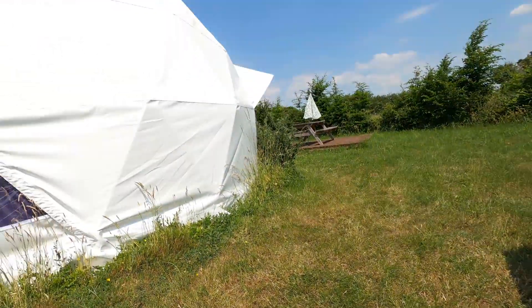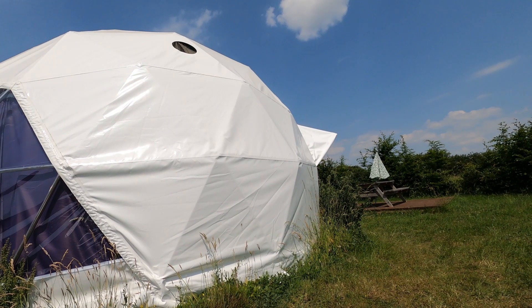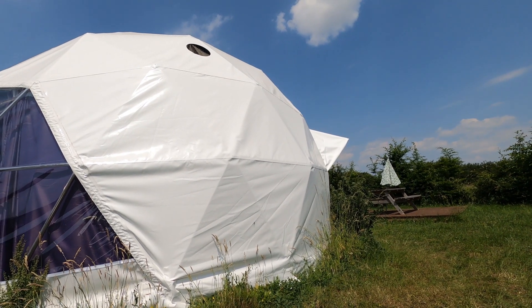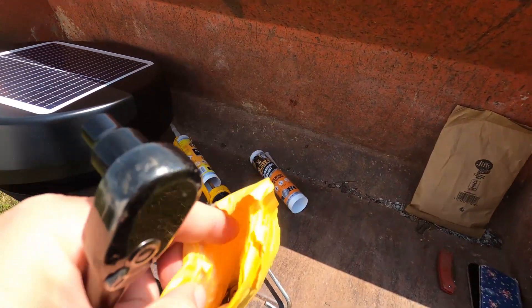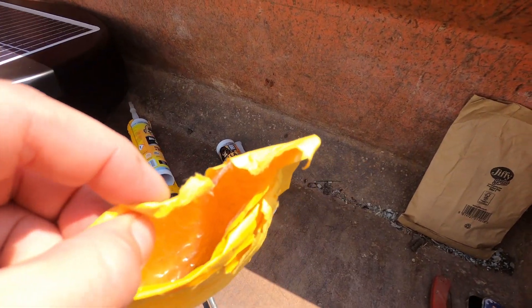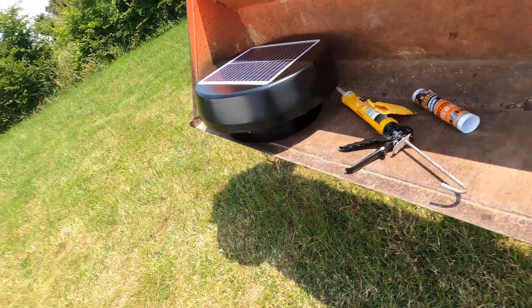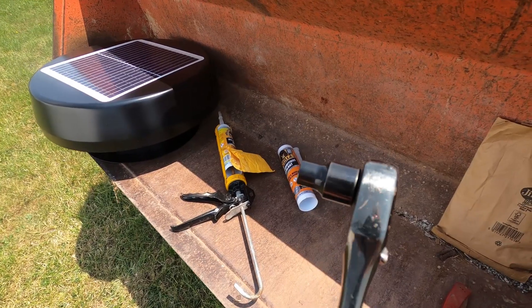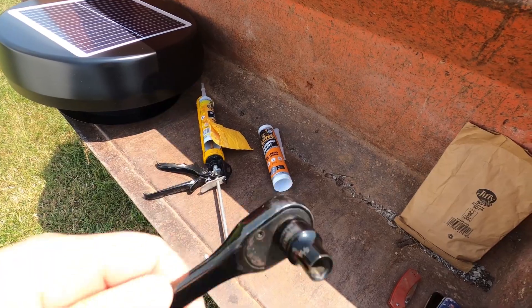I'm going to get this up in the bucket of the tractor and then I've got to hold it up onto that circle while Brian's going to poke the holes through from the other side. We've separated out the hardware — I've got all the nuts and the washers, and Brian's got all the screws and a set of washers. You also need a ratchet — this is a five-sixteenth — so that you can put that on the nut.